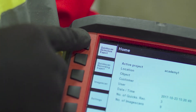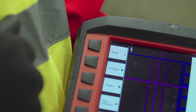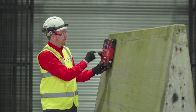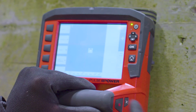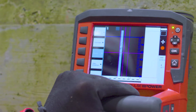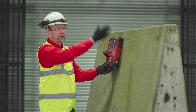I switch on the quick scan detection mode using the top button on the screen and then position the scanner on the wall. Then using the start button either side of the handle — the red start button — I can switch the tool on and start to scan the concrete slowly and smoothly in a horizontal direction, searching for the vertical bars.